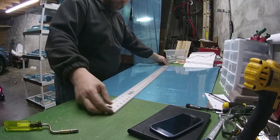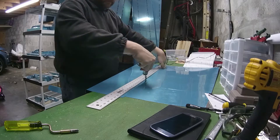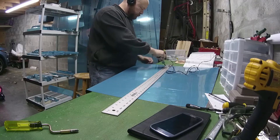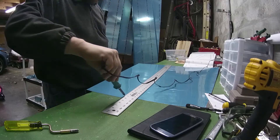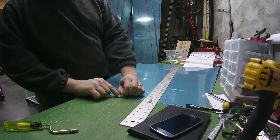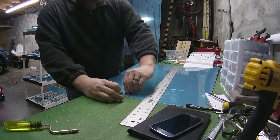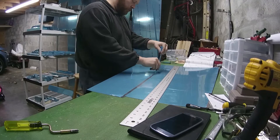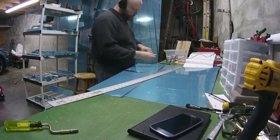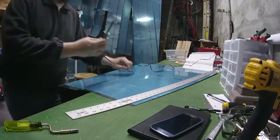Once you're done with the matched drilling, you have to deburr both the skeleton and the skin. One problem is the skin still has this protective coating. One really clever thing that I saw on Ed and Colleen's website was that they were using a soldering iron to just draw a line across the blue plastic vinyl, which would basically give you a crease and allow you to rip off just that one piece. So I pulled out my trusty 30-some-odd-year-old soldering iron and gave it a shot. I do need to round the tip a little bit — I'm worried it's going to mark because it has a very sharp point. But it worked really well, and I proceeded to do the rest of the skin using the soldering iron and then start the deburring process.